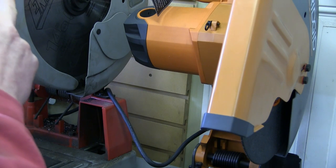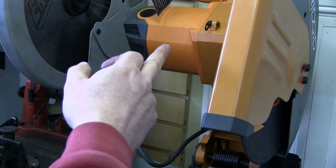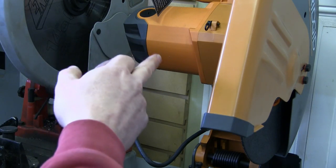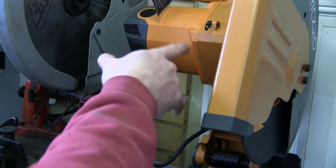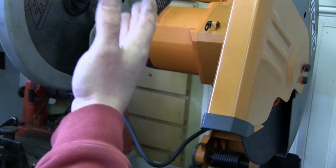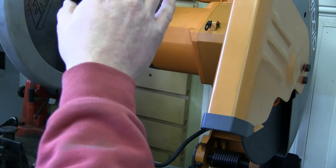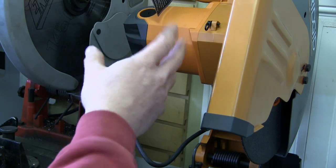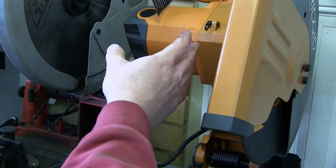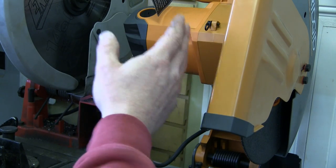This thing's rated for spinning at 1,500 RPM — 14 inch blade. This one is 3,900 RPM that it spins at. So, over twice as fast. What we need to do is half the speed on this. Beautifully, the type of motor on here is a series wound universal motor, so it'll run on AC or DC. It's got more torque on DC. But the beauty of this is it has the most torque at the low end — it starts off real grunty. It's not like one of those cheap compressor motors. This is the perfect type of electric motor for tools under variable loads.